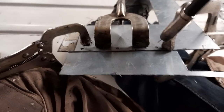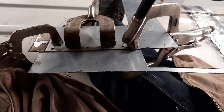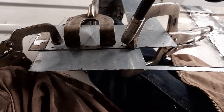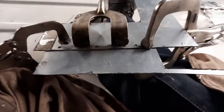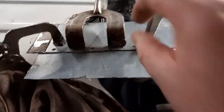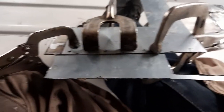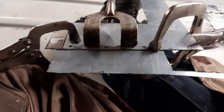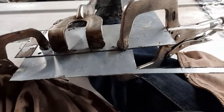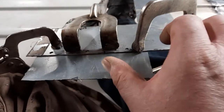An orange glow will appear, then you can see through the mask again. What I then do is do a second burst on it - burst number one goes maybe two or three seconds, burst number two goes maybe two to four seconds. It depends - you'll see the red pool around the weld getting bigger. Then the third time, hold it on for a bit longer again.